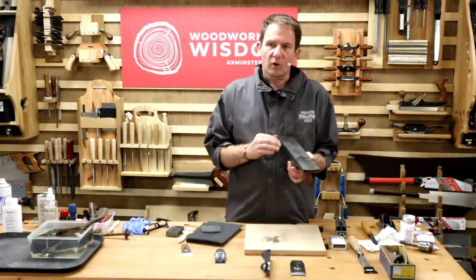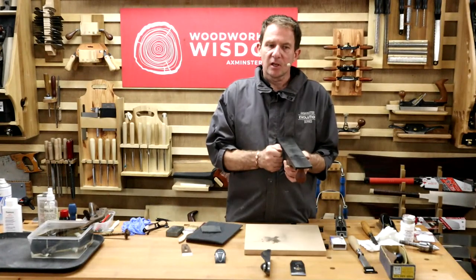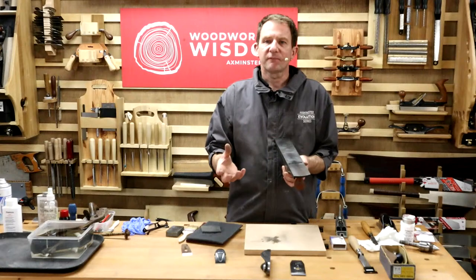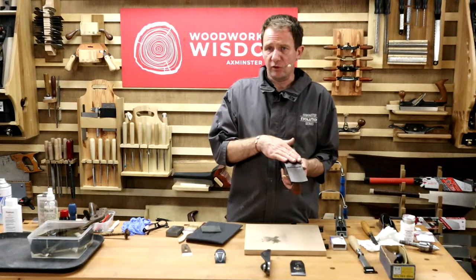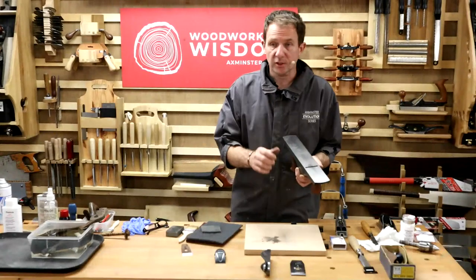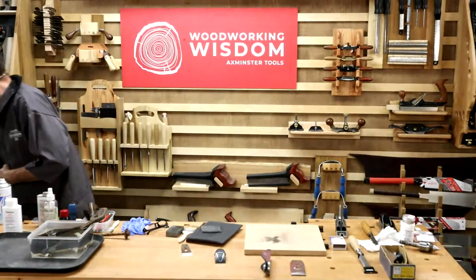By putting the camellia oil on, yes, I've sealed the surface, but I've not got the water out. So if you've got something that gets really wet, put it on something heated, top of a radiator for 3 days. Get it to dry out within the metal surface. Then do the rust bit. Okay? So hopefully that explained that one a little bit there.